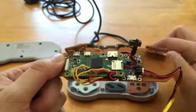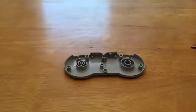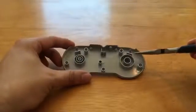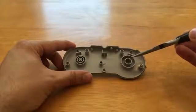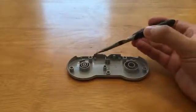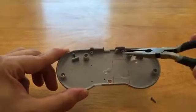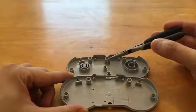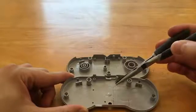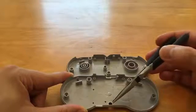Next I'll talk about how I wired the actual controller buttons to the Raspberry Pi via the five pins on the controller board. The standard Super Nintendo controller has plastic backing to keep the buttons pressed in place, but that takes up the space where I want to store the Pi, charging cable, and battery, so it has to be removed. I also removed an unused post, another post to get the HDMI cable through, and a screw post at the bottom — the other four screws are enough to keep the controller closed.